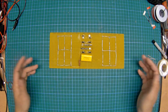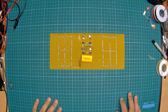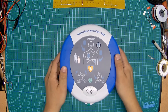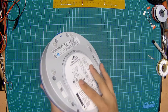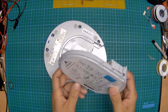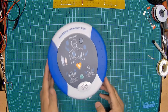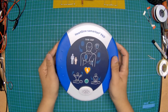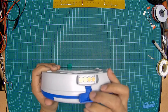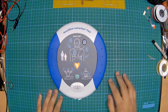And sets of LEDs that indicate the direction of current flow at different energy levels. I modified this circuit, so I'm going to have to work out just what energy level each of these triggers at. The organization I got this from didn't realize — and I didn't realize — that these are cartridge-based. This is the part that expires: there is a lithium battery in here as well as electrode pads, and that's the only part that expires. The actual unit itself does not expire. It has a decent weight to it, and even has a USB data port to collect after-use statistics.